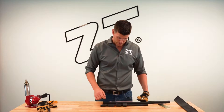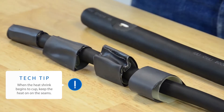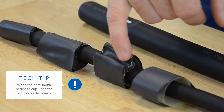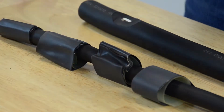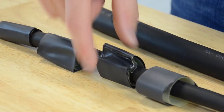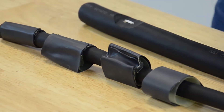The stronger that seam is, the more we can allow it to cool before moving to stage three. As we continue to heat the seam, you'll see a cupping phenomenon — the PRT will want to curl up. Just keep feeding heat across the seam, focusing on what I call the lips, and it will flatten out. Eventually the seam flattens and looks like this.